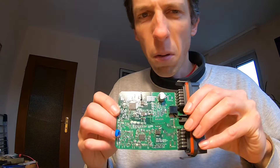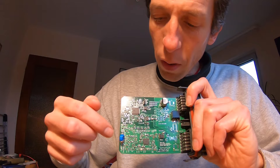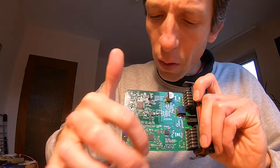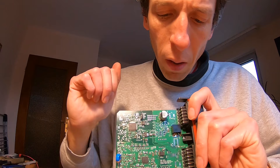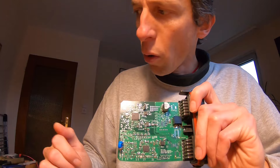That's why Yuhi from Ingolstadt has developed a more embedded version, and that's this one right here. What you see is a power line modem in the lower section, with a little transformer and a QCA chip soldered directly to the board. Some filter components are missing but they're not crucial. Up here we've got the STM32 with a CAN receiver, and not yet populated: drivers for contactors and the lock motor.